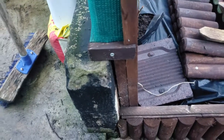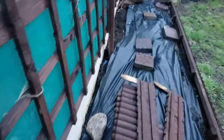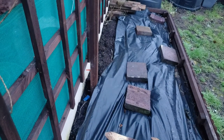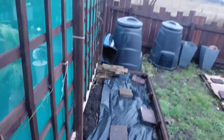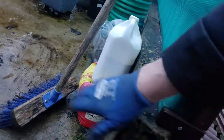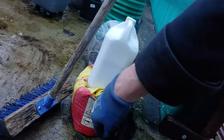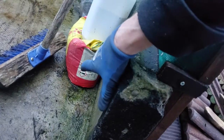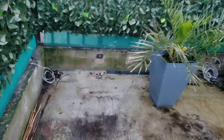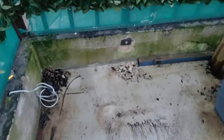See that? So, these three, you can see that one out there's pulled right out. You can see the red raw plug on it. So these first three here, 1, 2, 3, what I'm going to do is drill through the wood, straight through the wall, put a stud right through the wall there with a big washer on it, bolt them in. And that's what I've done on the other side over there, look, as you can see.